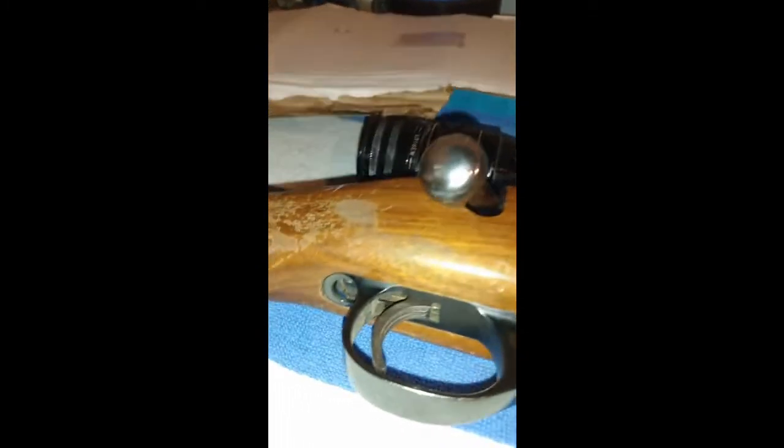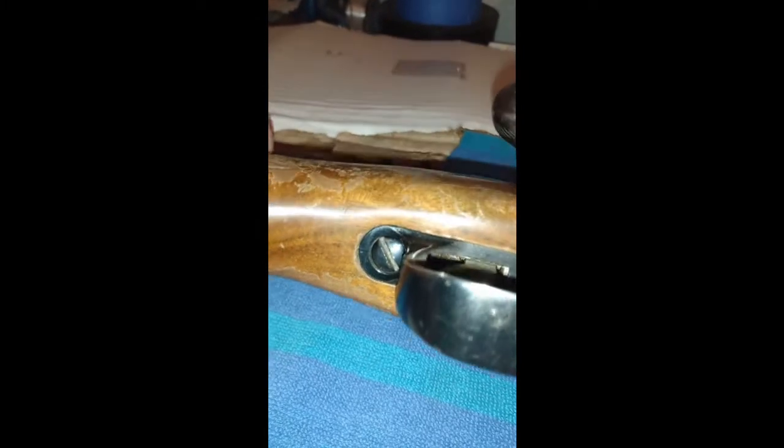When you're looking at the head of your screw, it comes in kind of like this, and most screwdrivers are tapered, so you're getting bite right here and here on your screw head, and that's what causes that roll on the screw. I'll show you guys that one more time here. See that roll, you can see it real prominently.